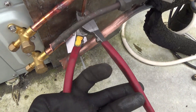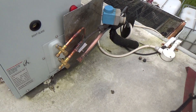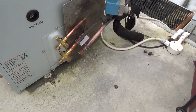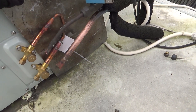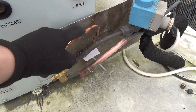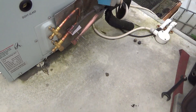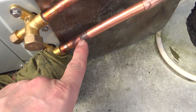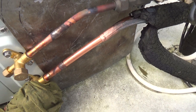And then we want to cut this because it should have a little heat shield. Get that in there like that, and then we just heat that up and pull it out, pull it off of there. Done the top one — so there's that one there and that one there. Quick nitrogen pressure test.